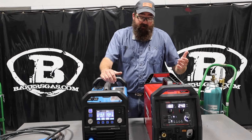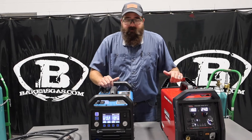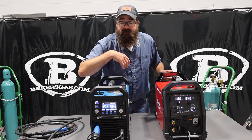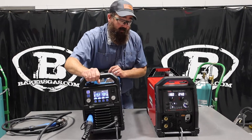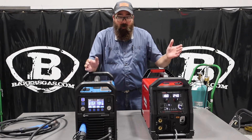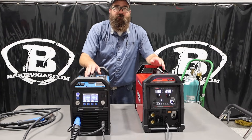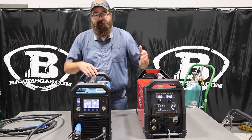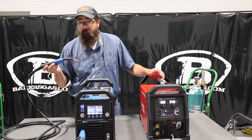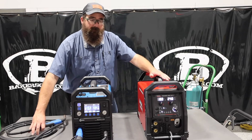It's very interesting to put them side by side — people see pictures but never see them together, so it's always nice to take a look at these things all together. Both of them are very robust. We'll link all the pricing down below so you can check out the difference in that. They're both nice machines and I've welded with both of them. To pick one over the other it's comparable, but there is a price difference, so check that out. The new Miller 211 Pro comes with a 15-foot MIG gun and a 15-foot ground clamp, so you can get further away from your work table. The Lincoln has a 10-foot on both — that's a big, major difference.